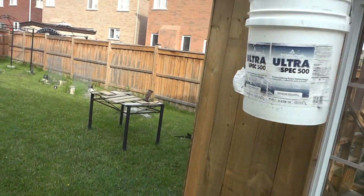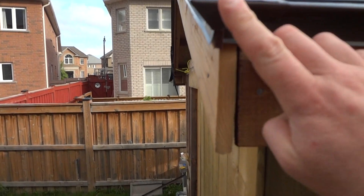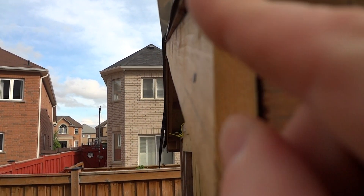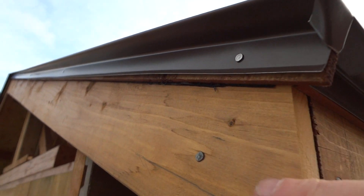For the corner I'll show you what I did — I didn't want to waste time making weird angles that look like garbage. This is my end result: it looks pretty nice and flush. All I did was take a small extra piece, stick it under this one and over top of this, and cut it right where my little board was. That board is a pressure-treated spacer — it seals that off so hornets and stuff can't get in there.